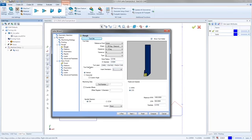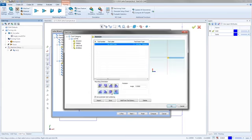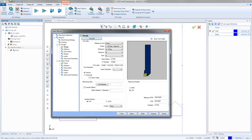This is a whole section for your tool orientation. So for this part, you have 4 different orientations under vertical. You'll have 4 different orientations under horizontal. In the old systems, there was orientation 1 through 4 for turning, and then facing was 5 through 8, which when you're inside the tool crib, we still do call it that way. But primarily, the 5 through 8 are going to be on your facing geometry.